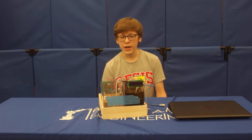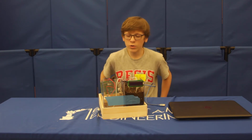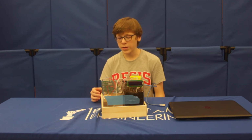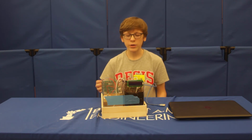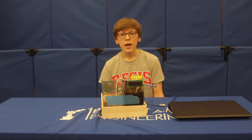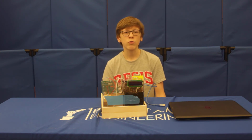One of the problems I encountered with this design was that I had a lot of wires and they're really disorganized, all on this perf board, and a lot of times they'd break off. I had to find a way to keep them on and to keep them organized without them falling off and being damaged anymore. I basically reworked my whole design and figured that out. One of my next steps is to hook up a Raspberry Pi and to make a live graphing chart on a server hosted by the Raspberry Pi, local to the Wi-Fi.